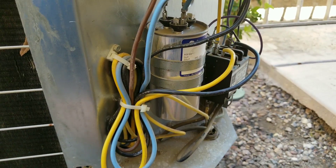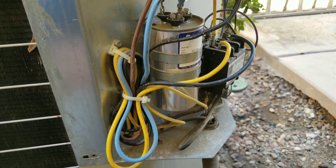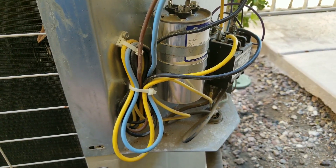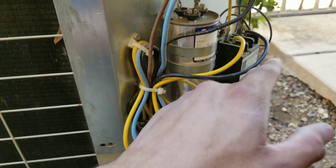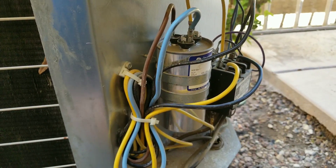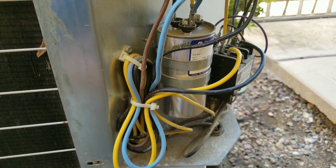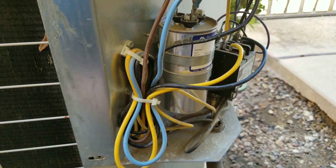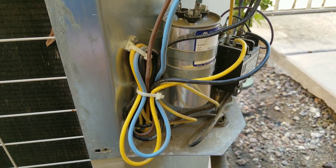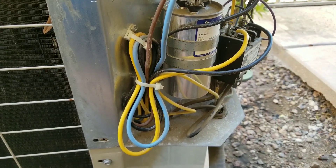The reason it's a good practice to check the amperage of the compressor is because, number one, oftentimes when you have an older compressor and it overamps during startup, it will cause your breaker to trip. That's one way to check to see if you're overamping when the condenser or the compressor turns on. This is also a good method if you aren't sure if your compressor is running. If you don't have gauges, there's no way to determine if your compressor is running because if it doesn't have refrigerant, the compressor will sound like it's off. So you'll want to use your multimeter to check for amperage to see if you do have power going to your compressor.